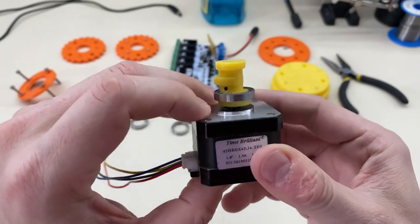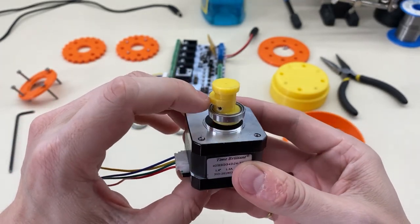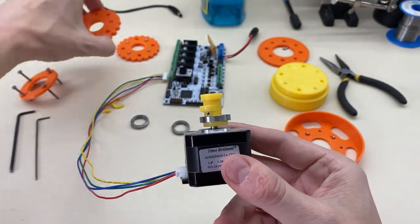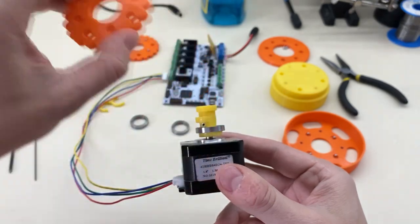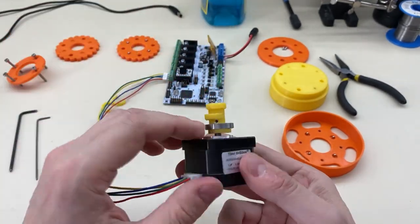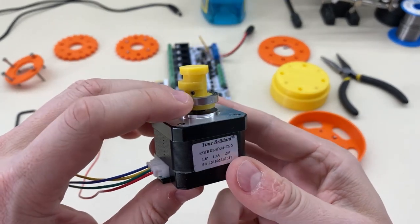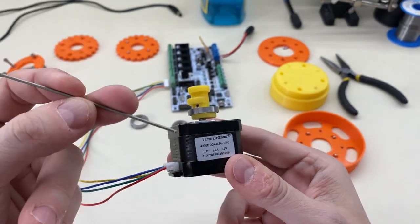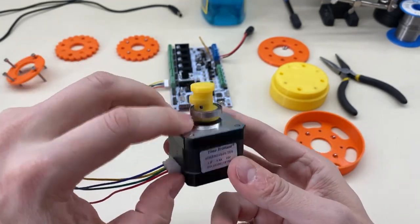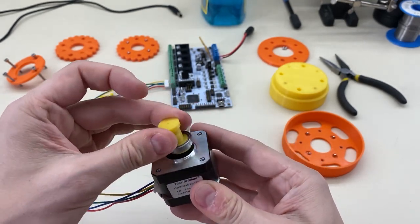This is the eccentric. The deviation is one and a half millimeters on each side because the teeth around the outside of the gear are three millimeter, and these screws that it drives around are three millimeter. The eccentric has a set screw over here — a three millimeter set screw that needs a 1.5 millimeter Allen key.